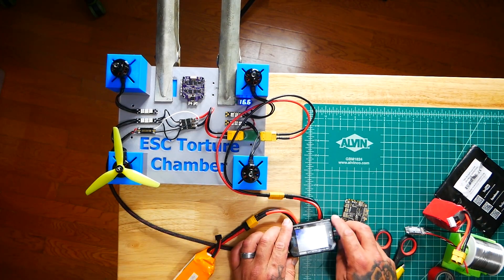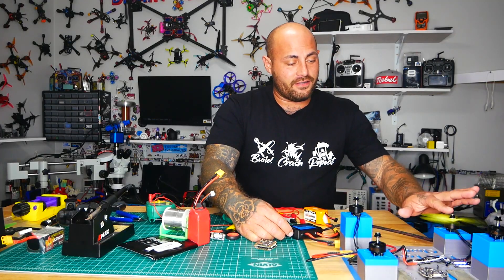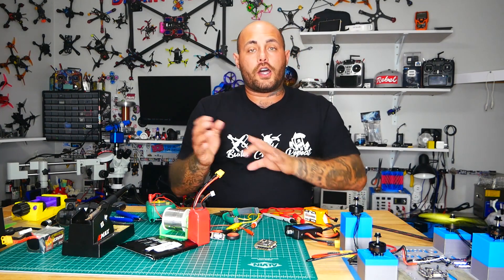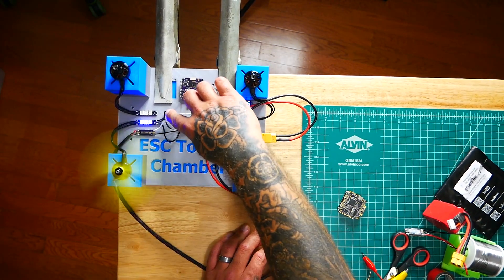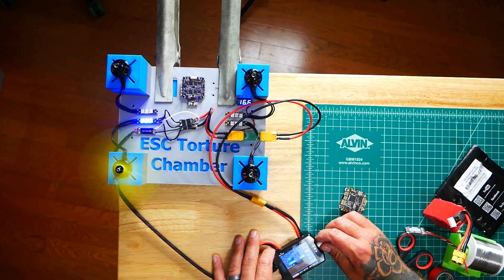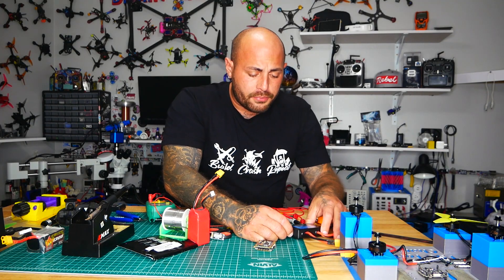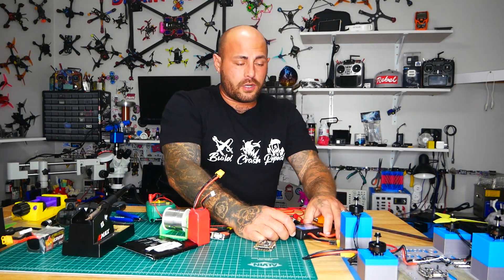Here we go, pilots. She's live. I do want to say — we're just going to warm it up a bit. Right now I have the propeller on backwards. I don't want to draw too much amps just yet. You can see by the lit-up LED race wire which motor is spinning. We're running 16.6 volts. We're pulling about 67 milliamps. That seemed pretty clean and nice — a max of 0.6 amps, 11 watts. We pulled about 4 milliamp hours in a minute and a half.